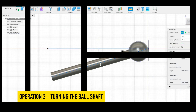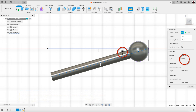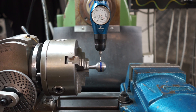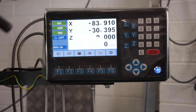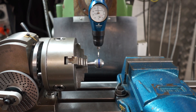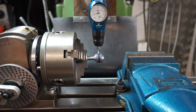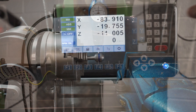We're going to move on over to the milling machine. Before I can set up the dividing head I went into my CAD system and modelled what I have to make. I've roughly worked out the angle I need to be on is between 15 and 16 degrees, although the CAD model said 16 degrees — I'll adjust and take a look. I'm setting up with the probe to find the centre position in the Y-axis, then touch down on Z to find my Z-zero height, and back and forth to find the centre of the Y-axis.